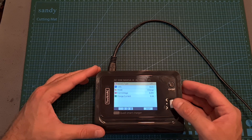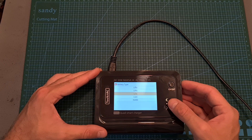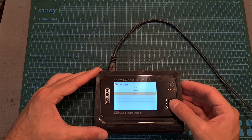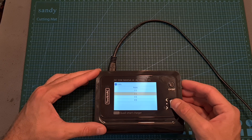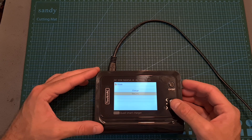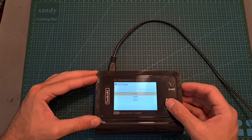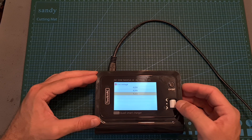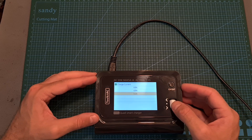Then over here, you can configure the battery type between the following options. The supported battery types are LiPo, LiHV, LiFe, Li-ion, NiMH, and Pb. The number of battery cells can be determined automatically, or if you'd like, you can set it manually. The mode can be set to charge or storage charge. You can adjust the end voltage per cell according to the battery type that you selected and the charge mode. And finally, the charge current can be set between 0.1 all the way to 5 amperes.